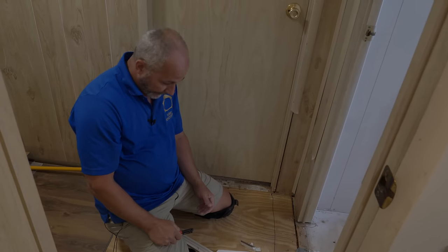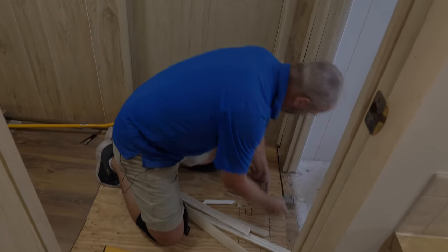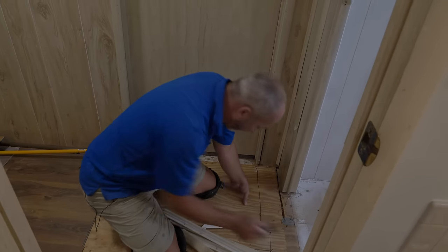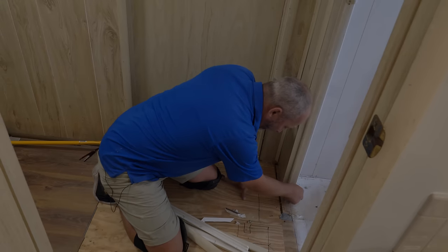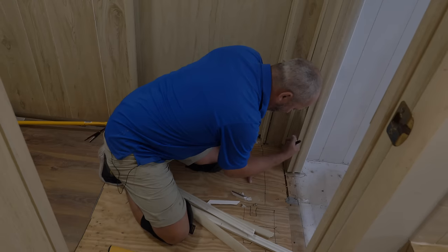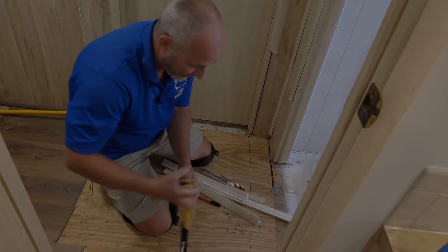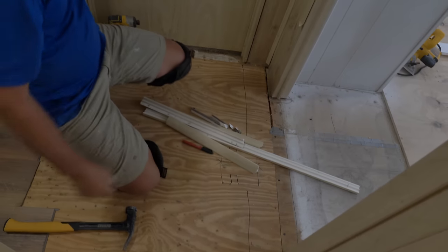When we get to the flooring section of this video, we're going to cut back these little pieces and install the flooring right tight to the jamb — it's vinyl, so it won't expand and contract, no issues. We'll leave the subfloor a little bit shy but put the vinyl up nice and tight. Finish this piece with a little colored caulking and cover the gap with the casing and baseboard for a really nice finished look. That's the goal — make it look pretty. Let's finish ripping this out and then measure.